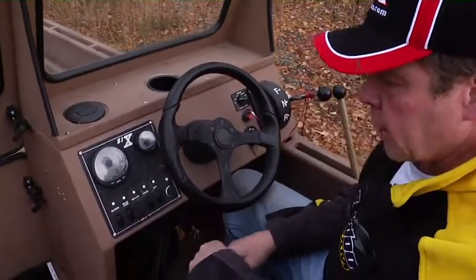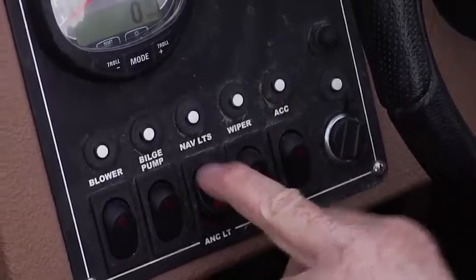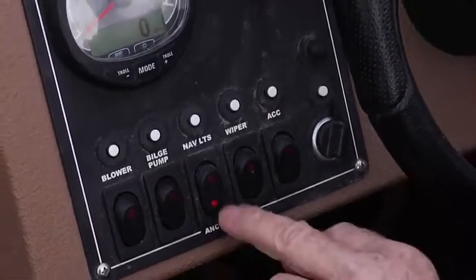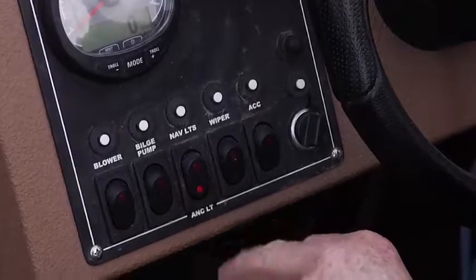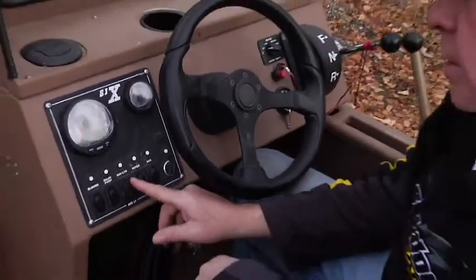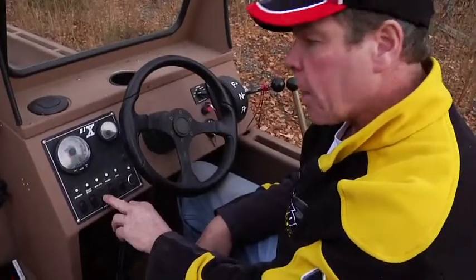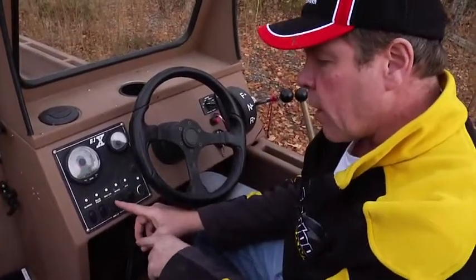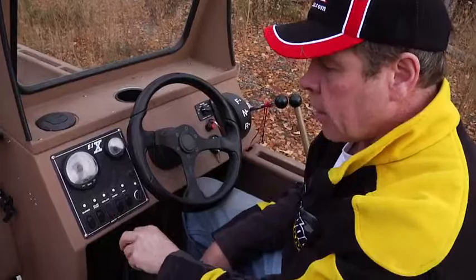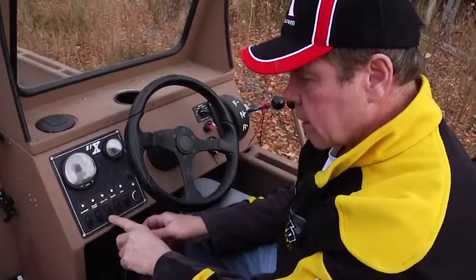The secondary pressure pump pumps water out if you're up on step, so you don't have to run the mechanical pump if it's raining. You have navigation lights on the side of the boat — Coast Guard required. Up is for running lights, middle is off, and down is for your stern light if you're anchored. It's important to leave this switch in the middle when not in use, as the panel stays lit when the gauge is on. Young kids may leave switches on and drain your battery, so consider a battery selector switch.